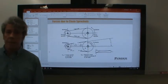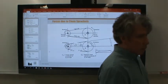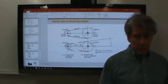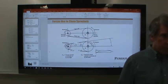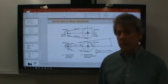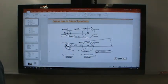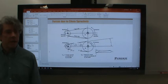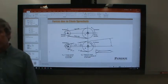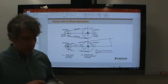After you calculate diameters, you've included stress concentrations by that point, then you know what size the shaft has to be along its entire length. And when you know that, then you can finally actually size each section. You know what the minimum diameters are. So you don't calculate, say, the shaft needs a 2.536 inch diameter and find a bearing that has a bore of that diameter. You have to size it up to the next size that the bearing will actually fit on if you buy the standard sizes.